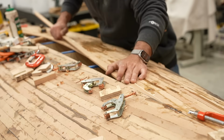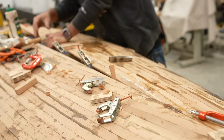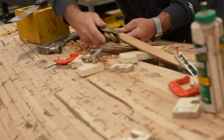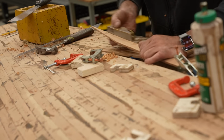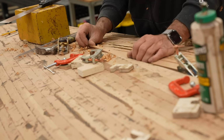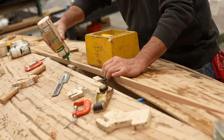You got to make sure it fits in one end, and in some cases I was making it fit in one end, clamping it in place, doing whatever I could to get it to stay down, and then shaping the other end in place. You get it to dry fit, and then it just seems right, and then when you go to glue it, it's too short. So it was a little difficult. So I was clamping with glue one end and then dry fitting the other end and getting it to fit. And I knew that I was going to put a keel down the middle of this, so if I had a little bit of gapping there, I wasn't going to beat myself up. So you could see all the tools in action that take place to try and close up the bottom.